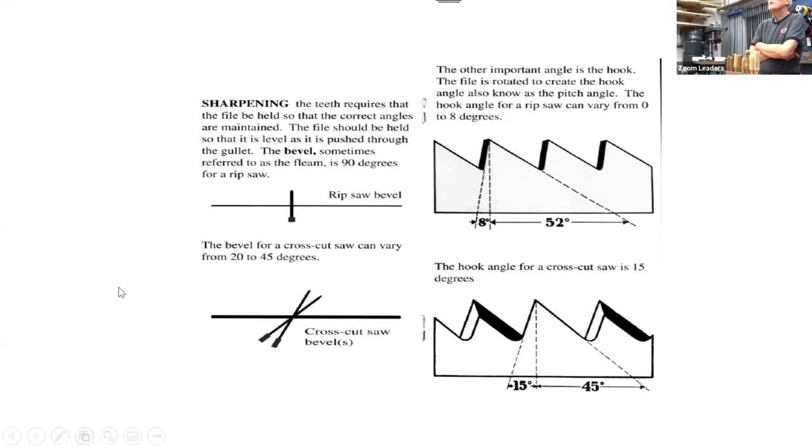Here's a slide showing how things are sharpened in the two different ways. For the rip saw, the file goes perpendicular to the saw plate. When you tilt the leading edge of the teeth you're filing, you want somewhere between zero and eight degrees of rake — that hook angle. At zero degrees, the tooth is straight up and down, giving a very rough, hard-to-push cut. If you tip the angle to between four and six degrees, you get a very smooth-cutting rip saw that's relatively easy to start.